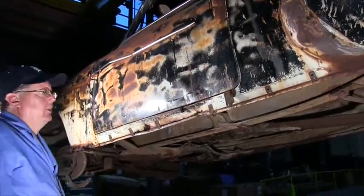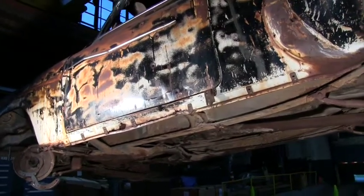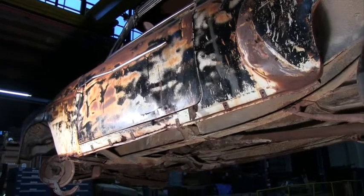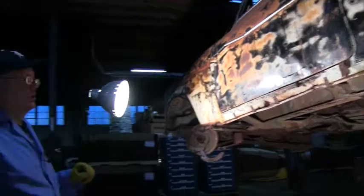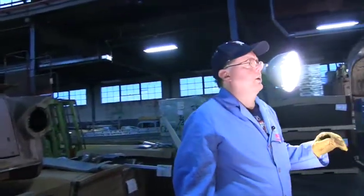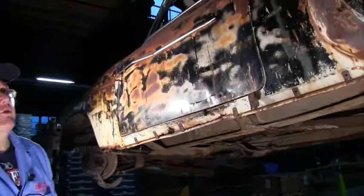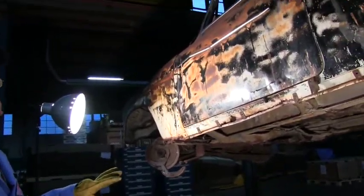go around. Using a floor jack, you usually overpressure or underpressure, and you don't want to have 8 or 10 floor jacks around while you're trying to do something or hammering shims in there. So I use the little bottle jacks that come out of the pickup trucks. As you go to the junkyard, you get them real cheap. You put them around the car wherever you need to hold it up. You need to apply some pressure.